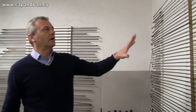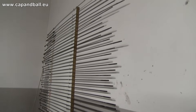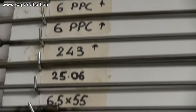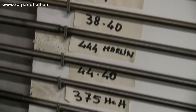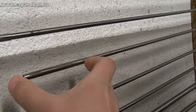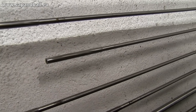You can get an idea of how many different calibers are manufactured here. The mandrel itself is the very heart of the forging machine — it is the hard steel core that holds the negative image of the future rifling. This is the form that the barrel is hammered onto. The precision of the mandrel is a key factor in making an accurate bore. Each mandrel is manufactured individually for a specific caliber, specific groove number, rifling twist, and rifling depth.